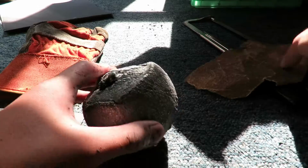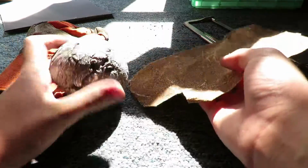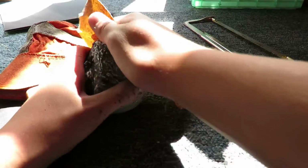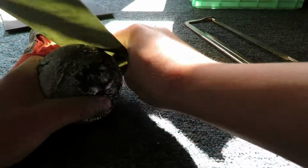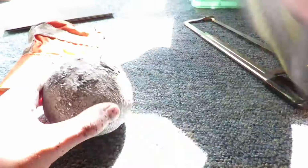After I pulled it out, I cut off the extra metal and sanded it down. I wish I had a polishing wheel so I could really get in there, smooth it out, get all the little dings out, and polish it up to make it look really pretty. But as you can see, it didn't turn out perfect, and I think I know why. It's because the ball isn't solid styrofoam. So as the metal came into contact, the ball collapsed, and the sand around it didn't hold its form, so the sand collapsed too, leading to this flat spot on the top.